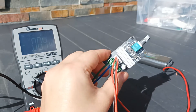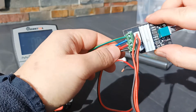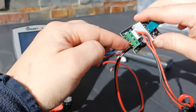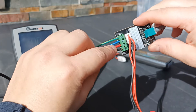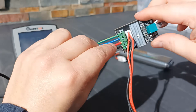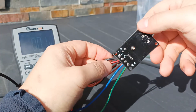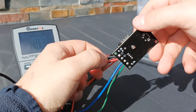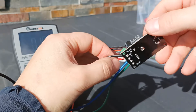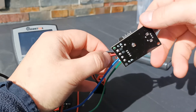I've already done some preparation — I've already connected the wires which are easy to connect, you just tighten the screws when you put the wires in. The instructions say you should be careful with the wires that enter the controller: plus should go with plus, minus with minus. Here you can see plus and minus, and we have this red wire — a positive wire — so it goes into the positive socket. It's important: if you install it in reverse you will burn the controller.